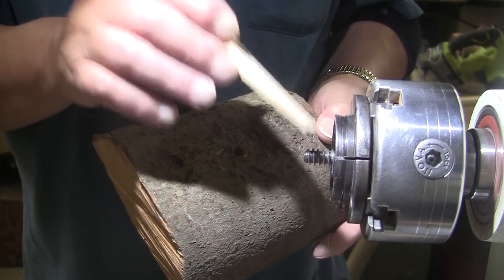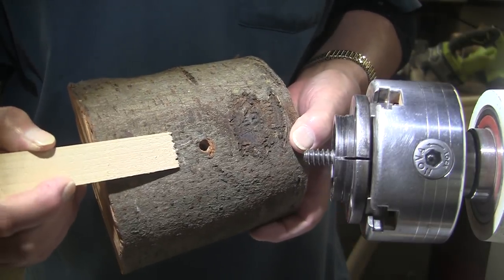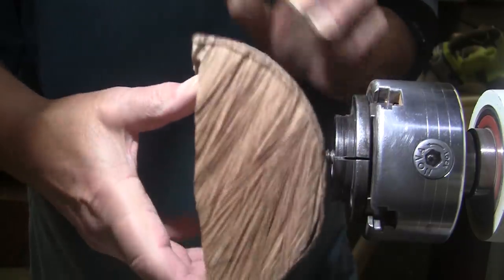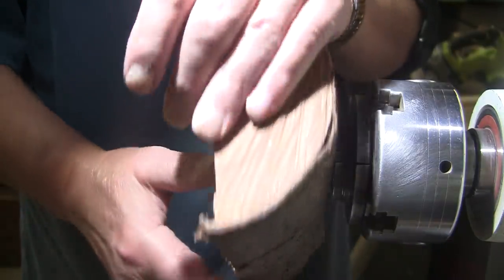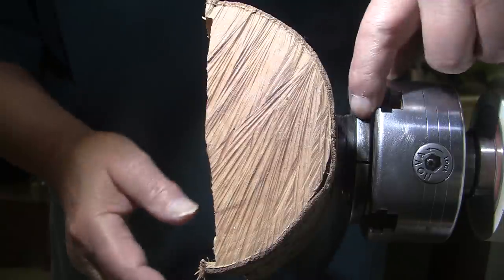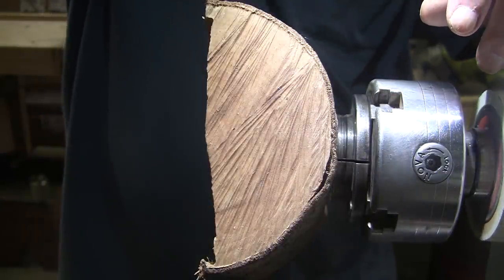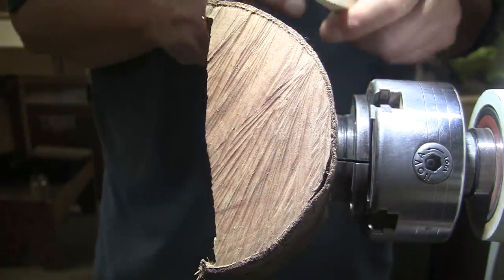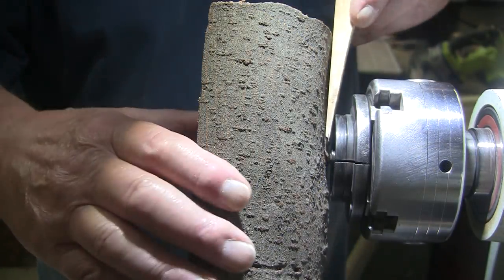I'm going to put it on this woodworm screw. I'm going to use this to shim it on this side, and I'll show you how that's going to work. So we want to get to the point where the high side is just about to touch. And I don't know, you can see that's the case there. It's just about to touch, or maybe you can't see. It's hard for me to get this light over there. But it's just about to touch there, so I'm going to take this little wedge shim. I'm just going to poke it in there.